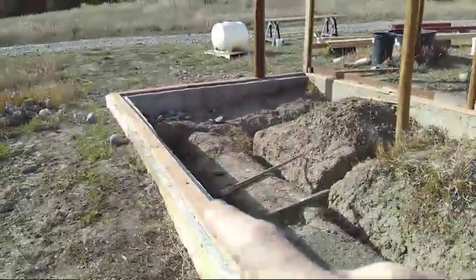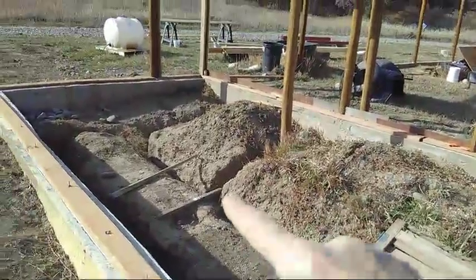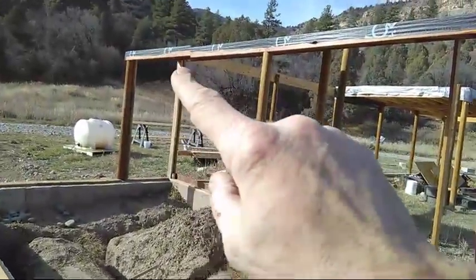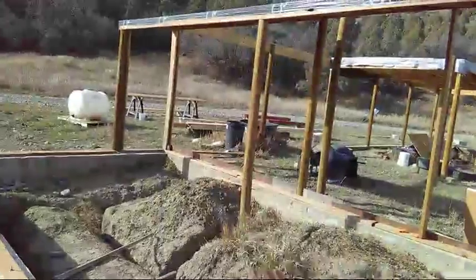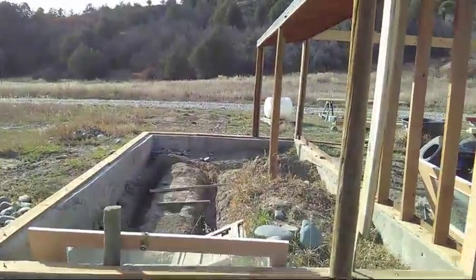This is super-insulated, R-40 all around. I got the base plate in — it just needs to be tightened down — and that's all you really need for a geothermal climate battery. We're going to be digging these tunnels deeper and putting in what's called drain tile, which is corrugated four-inch drain pipe with a sleeve on it. We'll be sucking the hot air from the top of the greenhouse and pumping it underground. The foundation is in and ready to be closed up — I'm not worried about closing it in winter, I'm focused on getting all these foundations done because I only have a few weeks left.